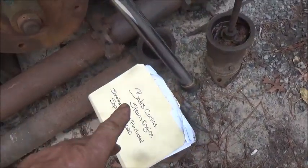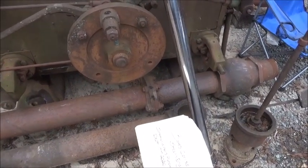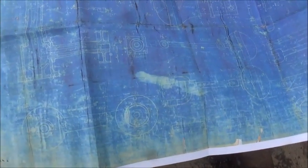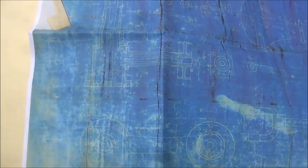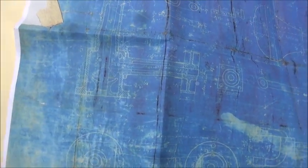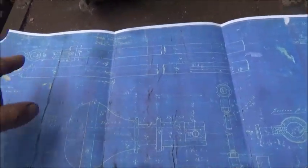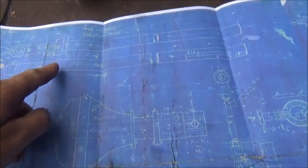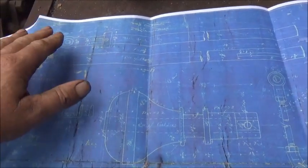We've got everything that's been sent to me and everything I've found myself, printed out — let me show you the blueprints. I can see them a lot better outside. I can see the bottom flange of this is 10 inches and the shaft is 1 and 7/16 inches. We've got our shaft here. I'm not steeped in reading blueprints — here's our shaft size so we can make the shaft. What it's doing is showing the shaft turned 90 degrees so you can get everything you need made off of it — shaft's no problem.